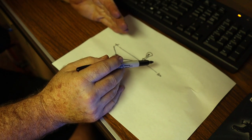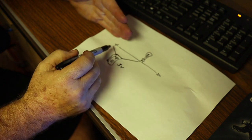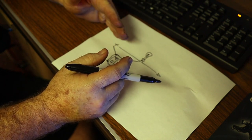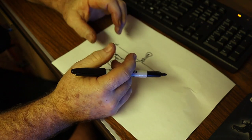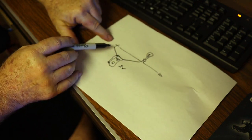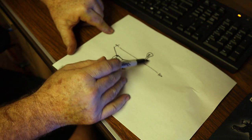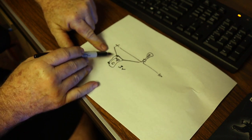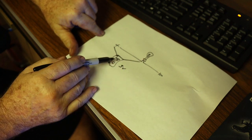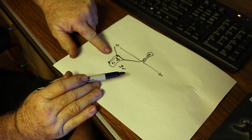Think of electricity like a water hose: voltage is the pressure, amperage is the amount of water coming through the hose, and the diameter of the hose determines the resistance or ohms. The voltage is pushing on the amperage trying to get it to the bulb. You can't read amperage with your meter, but you can read voltage — it'll pass through your meter to get to the circuit. Your meter helps fix the connection a little bit, and it shows you that three volts passes through the meter rather than through the circuit. That's how you know you've got voltage drop.